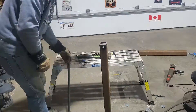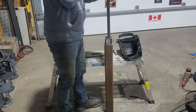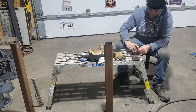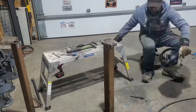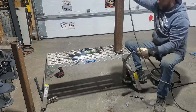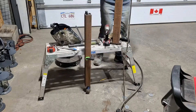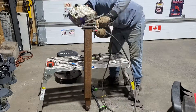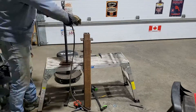Next, I fit the upper section of the jack over the lower section, then prepare a cap plate that will be welded to the lifting rod and bolted to the upper section. First, I weld the plates to the upper section. Then with the lifting rod supported, I tack the cap plate to the rod, then remove it to weld them together.